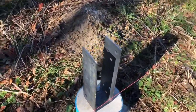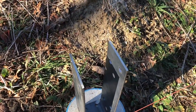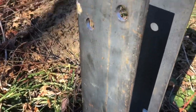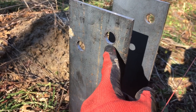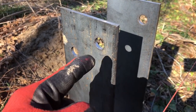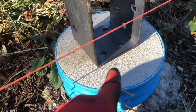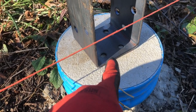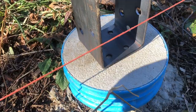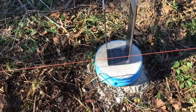It's a quarter inch — this is actually five inch bar stock. I laid it all out, we punched three quarter inch holes in the sides. That's to give me a little bit of wiggle room for actually lining up when I drill through my post. And then the bottom, I put some five eighths holes. I'm going to use half inch anchor screws, six inches long. That way I've got plenty of embedment into the concrete.